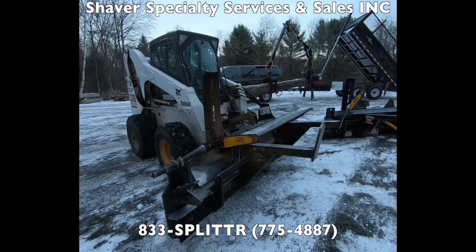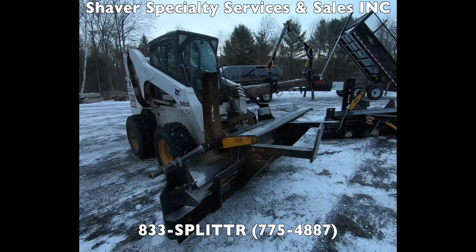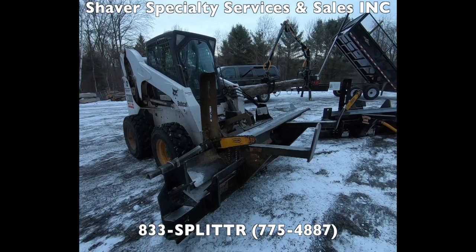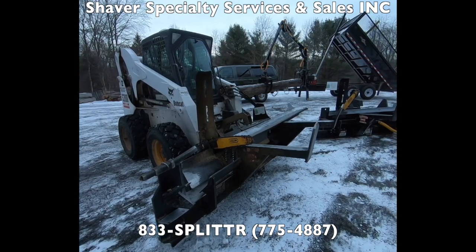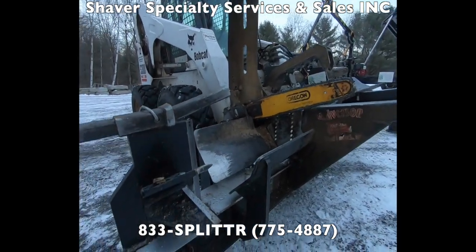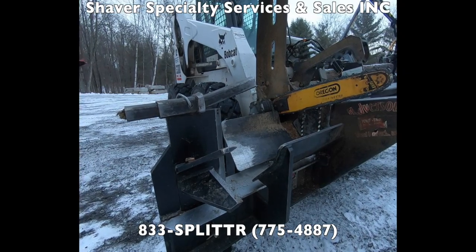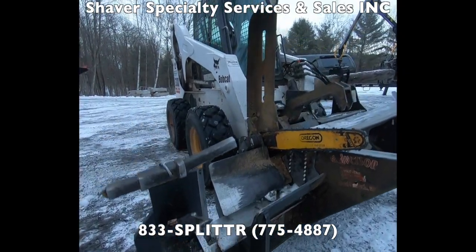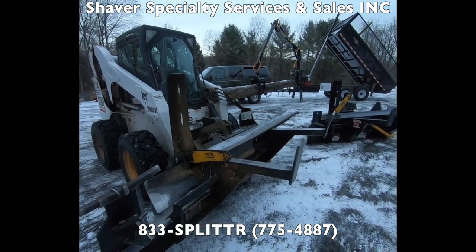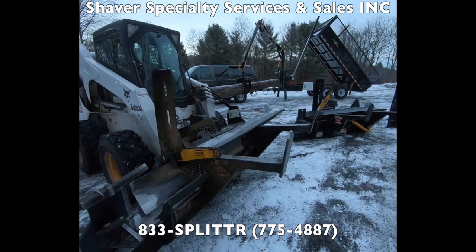We do have the six-way in here. And one of the big differences between this unit, the HD, and the B model is there is no internal log length cut guide on that. So that's why we have this little jig set up here on top of our machine, and basically what I'm using this for, it stops the wood early coming in, where the B model actually has a proximity sensor in it that stops the table on the way back to consistently stop the wood every time, so you have a nice even mix of what you're cutting off there.